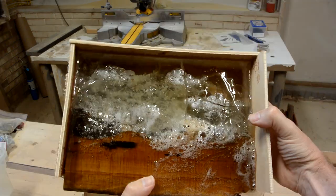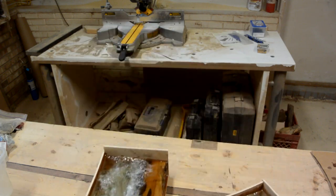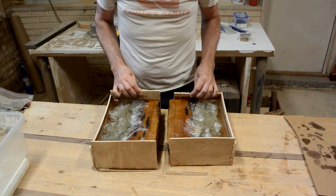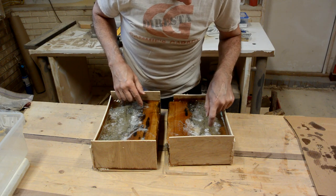As you can see, these are big fat failures. The same thing happened to these pieces as what happened to the very first time I tried this type of thing with epoxy. Obviously, I poured too much. It got too hot and cured too quickly. The epoxy basically boiled, set up, and cracked.